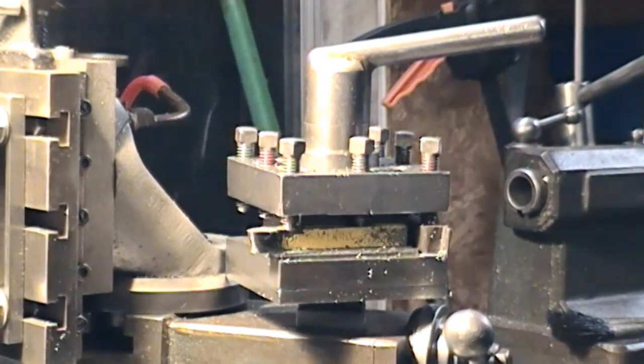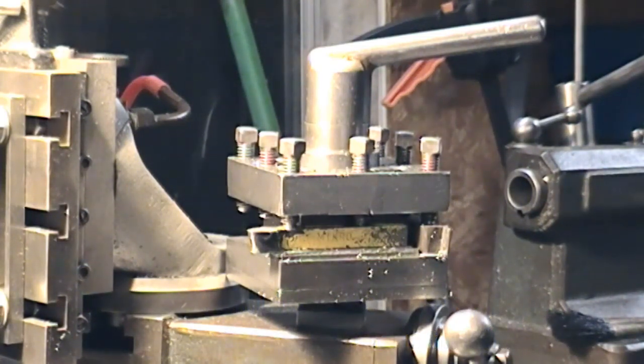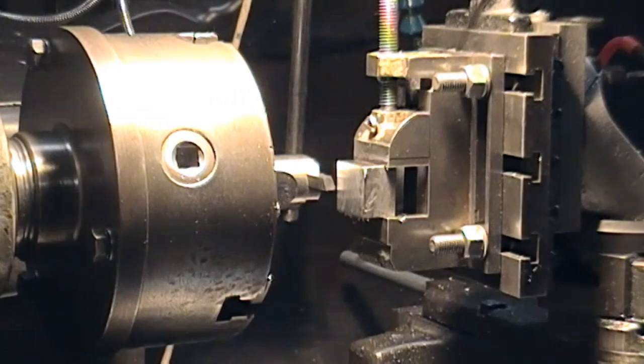That's all there is to it. However, I didn't have a chunk that I could make in one piece. What we're doing is making a sandwich — you've probably seen me refer to it two or three times. The main problem is getting the main material out of the two pieces so that when they are machined and sandwiched together, we'll have a five-eighths space for tooling all the way around.